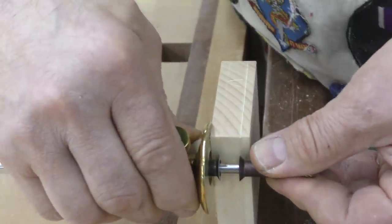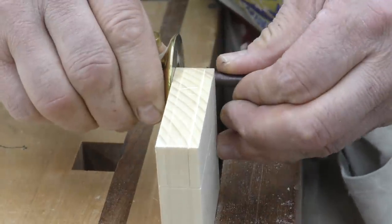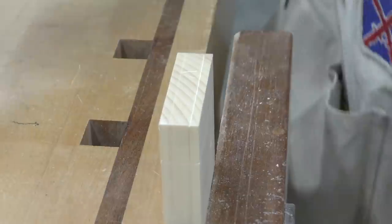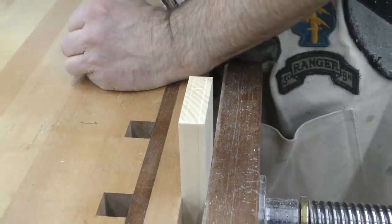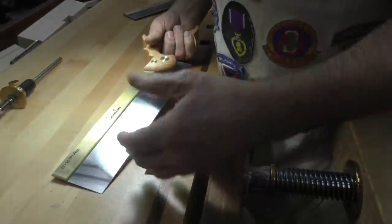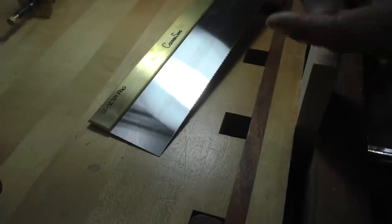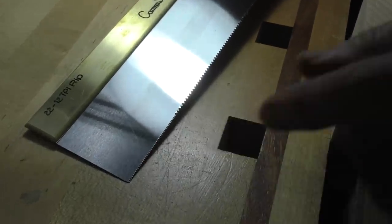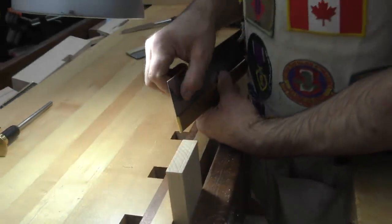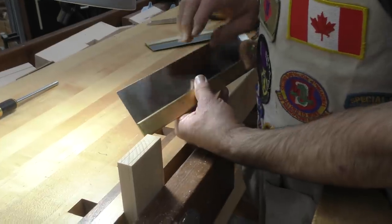Now we will go down the face and stop at the line, and the same thing on this side. Now I am going to use a tenon saw. How is a tenon saw different than any other? Well, it has rip teeth designed to cut parallel to the grain. Mine have little starter teeth up here. My tenon saw is a little bit heavier than a dovetail saw — it has a saw plate that measures twenty-five thousandths of an inch, so it is a little more stout. And I have a little more depth of cut; I can cut two inches.